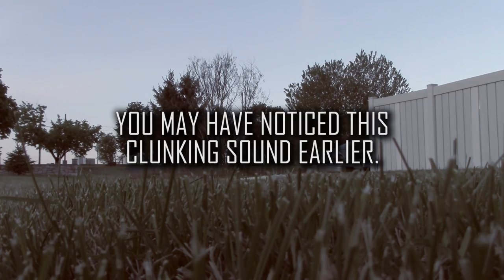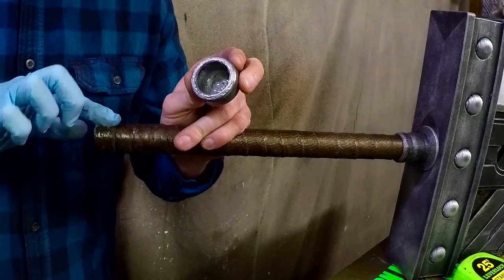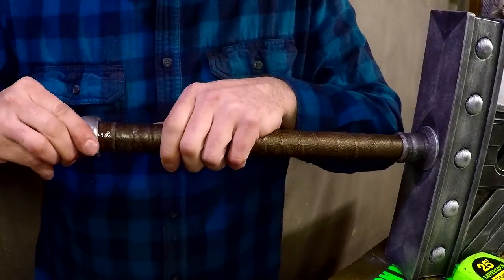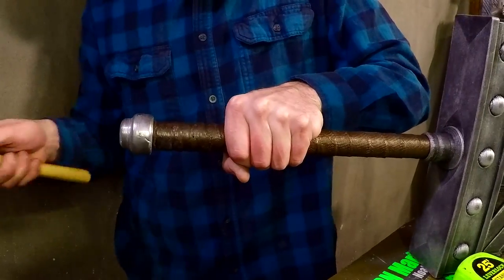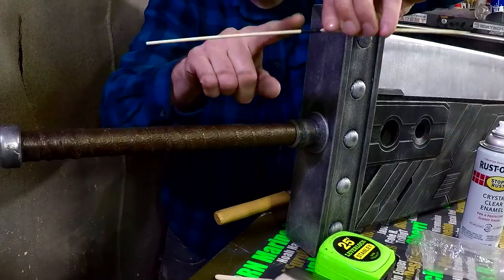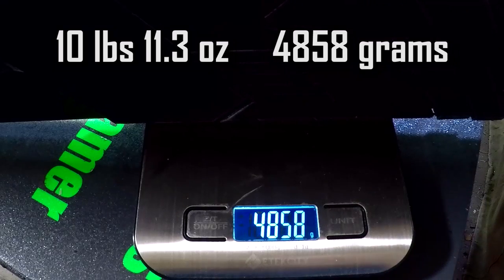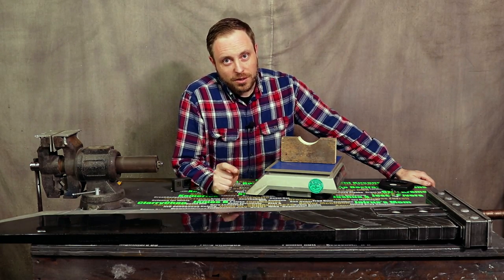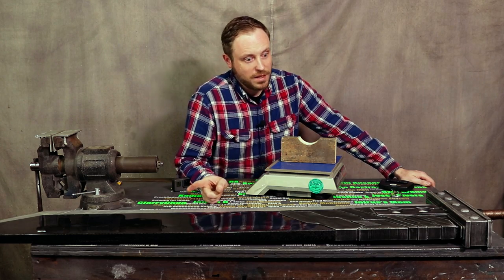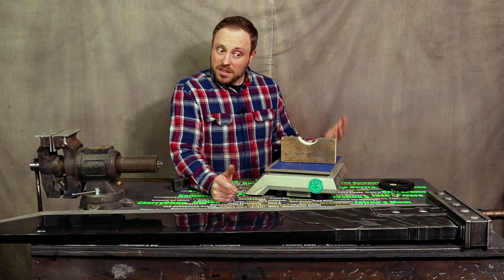My lead is loose — it's the smaller piece at the top. The handle hole reaches the materia slots, which are removable, so I just poured superglue down into it to lock it in place. The pommel fit great — a little tight, so I used a rubber mallet. I rechecked the depth of the lead rods with a bamboo skewer to make sure they hadn't moved when I hammered the pommel. The sword ended up with an overall weight of just over 10 pounds 11 ounces. I melted the rest of the lead and poured it into an aluminum tube to get a rod to fill the handle with, giving me an overall counterbalance weight of just over three pounds. Moving the balance back further means it effectively feels lighter now.